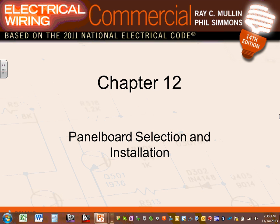As of this moment, ladies and gentlemen, you are using only panel boards, which can take you all the way up to 1200 amps. And guess what? Our largest panel was what? 500 amps. So we're covered with panel boards. They're going to be thrown against the wall. So Matt, when you pick them in Revit, remember that you pick these panels and you put them in the wall? These are called panel boards. They can go as high as 1200 amp, covered for this project. Next project, we're going to go to switch gear.